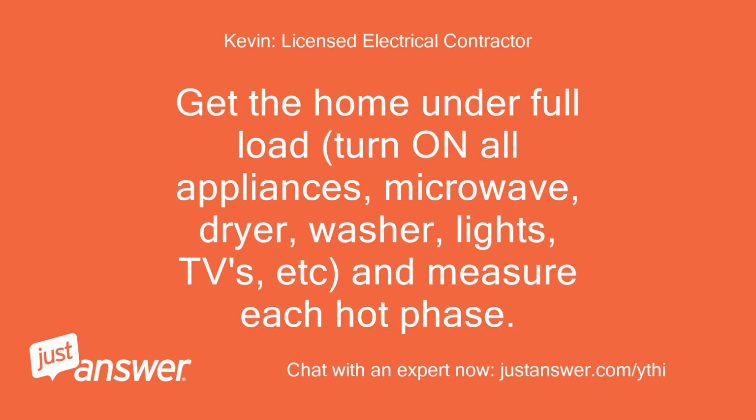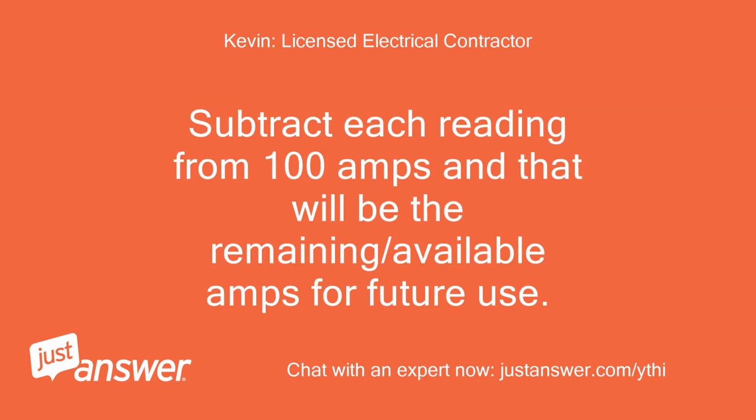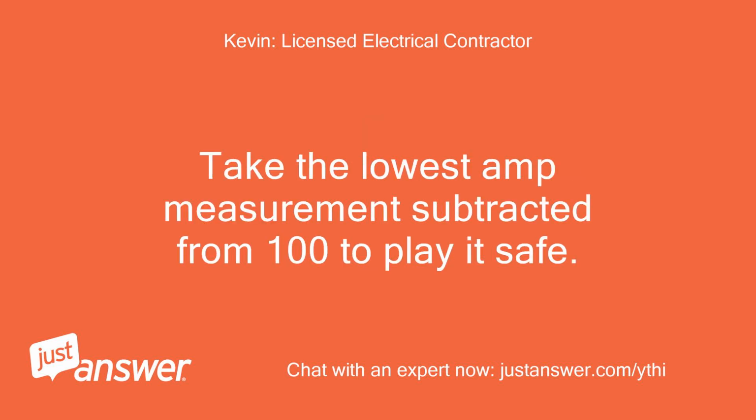Get the home under full load, turn on all appliances, microwave, dryer, washer, lights, TVs, etc., and measure each hot phase. Subtract each reading from 100 amps and that will be the remaining available amps for future use. Take the lowest amp measurement subtracted from 100 to play it safe.